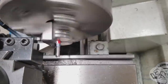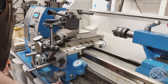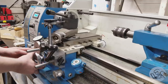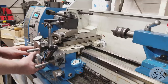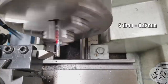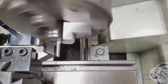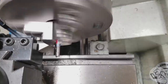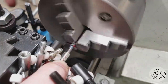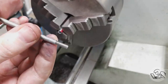There's an interesting subtlety here: anytime you're making a part where the factory stock is one of your reference surfaces, you have to be extra careful about concentricity. The chuck is referencing the OD of this stock, but nothing is getting turned down on that OD. So whatever I cut on the end is subject to whatever runout is in my three-jaw chuck — on these cheap chucks, that's around five thou. For just threads it's not a big deal, but for concentricity-critical features you'd want a collet chuck or dial it in with a four-jaw.